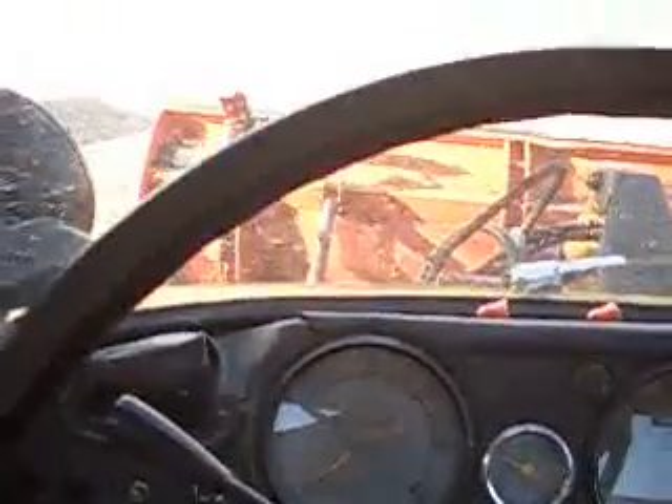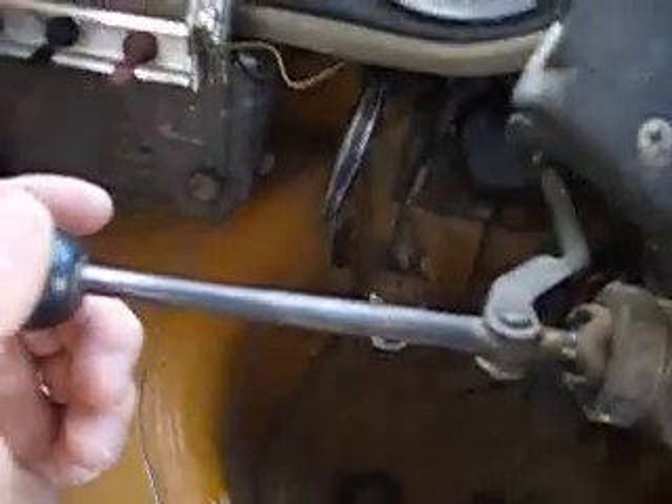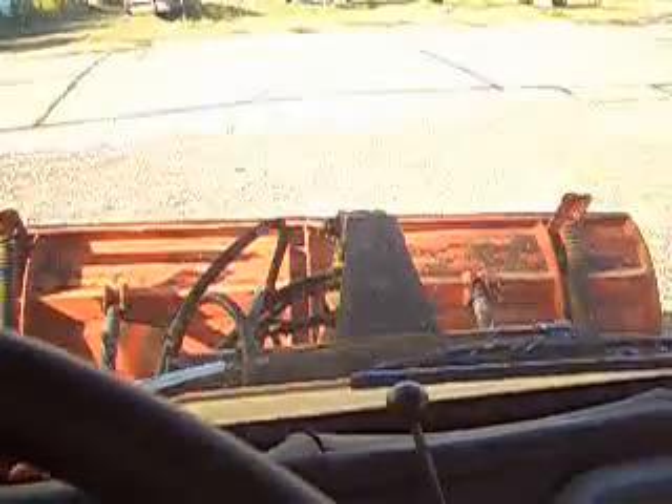Raise it up just a little bit if you want. Lower it just a little. You can use the other. As long as you pull it up, as long as it stays at the float, you're going to hold your position on your blade. But watch when I push it in the float — down we go. We're on the ground. And there is your float.